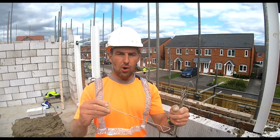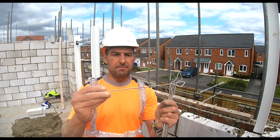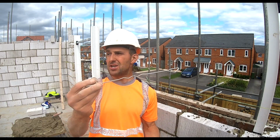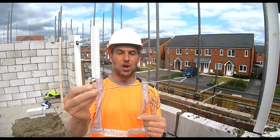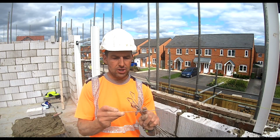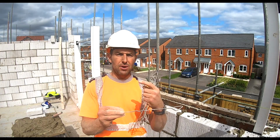Apparently, these wall ties are supposed to go a certain way. I never knew this, 25 years in bricklaying, never knew this. So this drip is supposed to be up, these two down. The agent told us tits down. So these two down, you know what I mean. The way I've been looking at it, trying to search which way to put it by looking for those two is tricky. I just look for the middle one and have the middle pointed up.